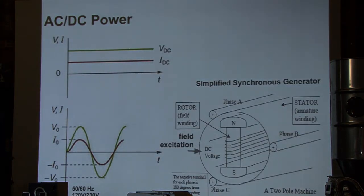To get into the technical description of how grid tie works, I wanted to provide a little preface on some basics of electricity. There's AC and DC power — alternating current and direct current. DC power voltages don't move around; they're held constant, the type of thing you get off a car battery. Generally solar systems and some small microgrids run DC. What grids run is AC power at 50 or 60 hertz, frequently created from spinning media generators or inverters. One of the things we need to do to connect this device to a grid is match the power coming out and get it into synchronization with the grid to provide power back.